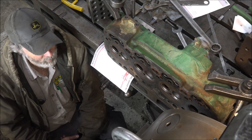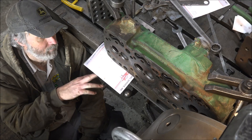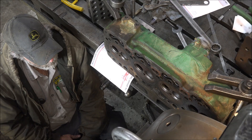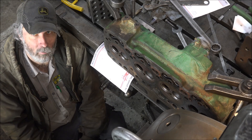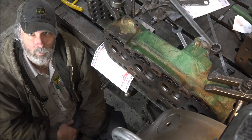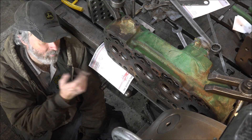I've got this all set up, indicated in, using my Area Diesel Service shim paper. Those shims work great for that — stack them underneath there and get a couple thousandths with a piece of paper. If you need more, you just put another sheet of paper. Thanks to Area Diesel Service for these shims.